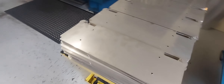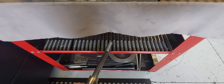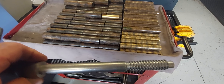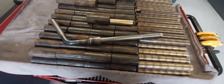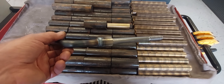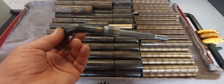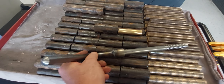One other thing to show you just to wind up the video: the Acme threads — I've got a video on my channel for those who are interested in cutting Acme threads on the manual lathe. Thankfully I don't do those on the manual anymore; now I do these on the CNC, which is great to have that machine. The main reason I brought this part over is just to show you the welding on a custom part that I make for an end user. That's just rotated by hand — not in a rotator — spinning it by hand and welding it with MIG. And I've just got to clean up a little bit of the start-stop at the end there.